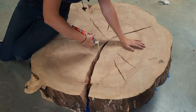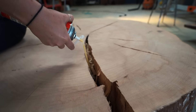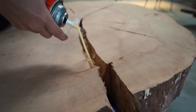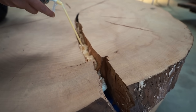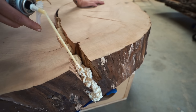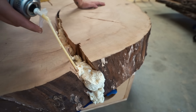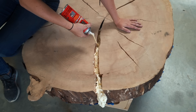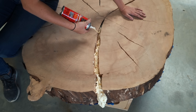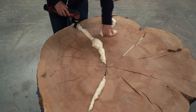This next step is going to be a 100% experiment. I need to fill all the cracks with epoxy — that's five inches — that's a lot of epoxy and a lot of time. So what I'm going to try is to take up most of that room with some spray foam, so that I only leave myself about a quarter inch to a half inch pour of epoxy. I used a straw that came with the can to get in as far in the cracks as possible. This stuff does expand quite a bit, so squirt in some then let it rise to see if you need more. I was aiming to go over flush so that I could cut it down flush afterwards. I found it way easier to fill up the entire crack over flush, then came back and knocked it down perfectly flush with my multi-tool. It's a very quick process to simply slice through this foam.